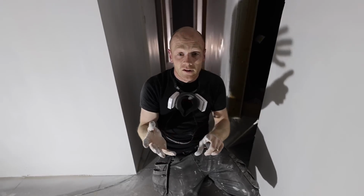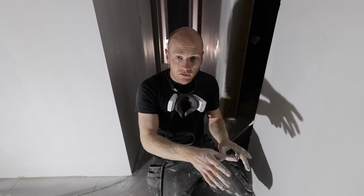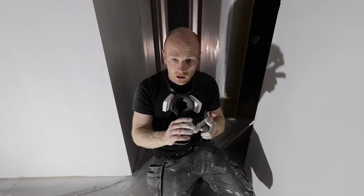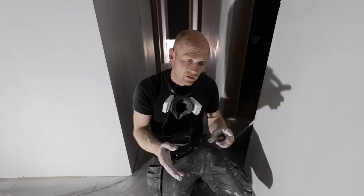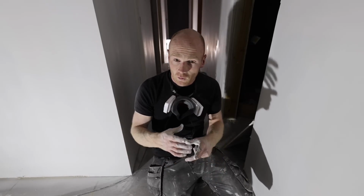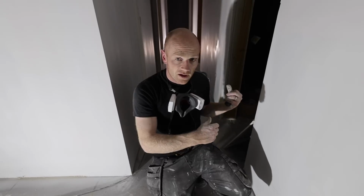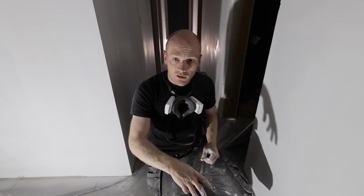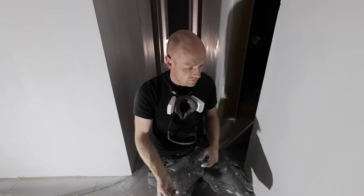Today. Now another question that always comes up in the spraying videos is, do you have to thin down the paint? I thinned down the first coat simply because it's a mist coat going on plasterboard. Usually you do not need to thin emulsion if you're using it with an airless sprayer. We've got an HVLP sprayer, you have to water that down and get the viscosity right, and it's a little bit more of a faff. This, you can just chuck that pickup hose straight into the emulsion off the shelf, obviously give it a mix first, and it'll just pick it up.